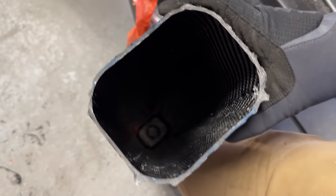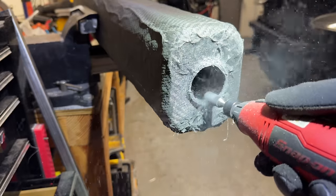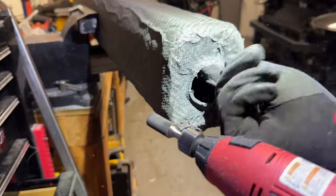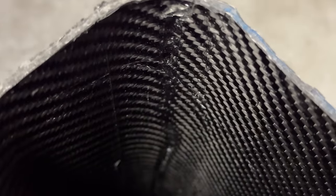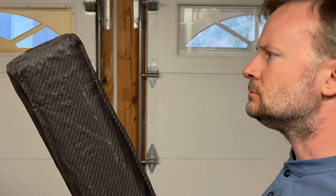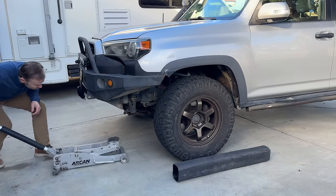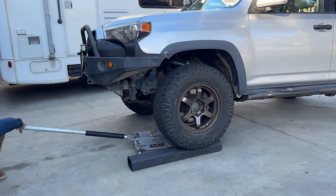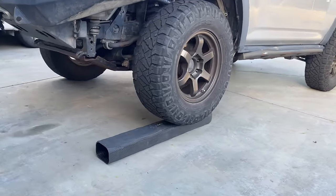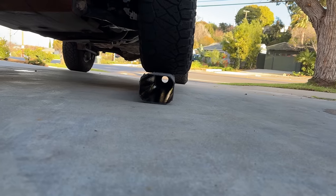Eventually we had a parachute tube — a kind of heavy parachute tube. I cleaned up the rear opening with a carbide spinny thing; the parachute line runs through here to attach to the car. I'll chop the other end to length after I finish the body design. There are some issues: the carbon didn't slide over itself — it just kind of folded up as the vacuum sucked it onto the mold, pulling the carbon away from the mold and leaving the outside looking like a long, hard, veiny shaft. We could have mitigated this with several smaller strips, but it doesn't matter for this part. As I said, this tube doesn't really need the strength of carbon fiber — I could have made it out of plastic. I don't know how heavy this carbon weave was and didn't bother to weigh it. Four layers was way too much — you could kill a man with this parachute tube. Absolutely unnecessary. Just how I like it.